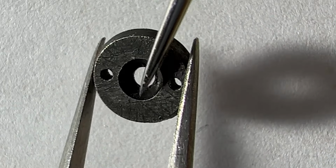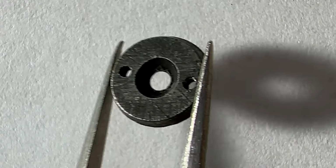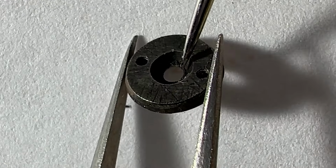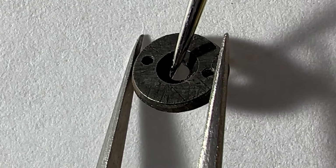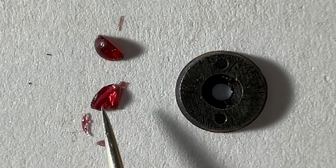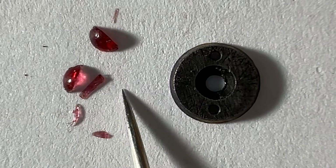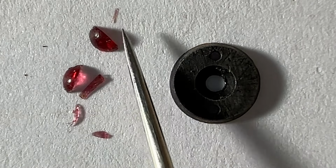The back side is unpolished and has a blackish finish left from the hardening process. Not sure about this burr on the inside of the relief hole. It may have caused the jewel to fracture from over-tightening the fasteners. When I removed the steel cap, the jewel fell out in pieces.